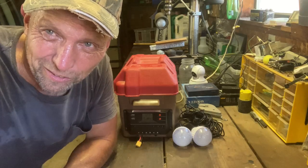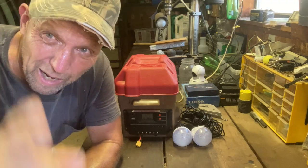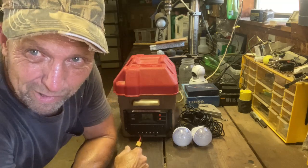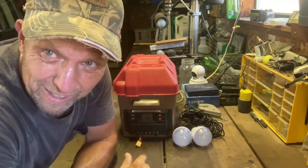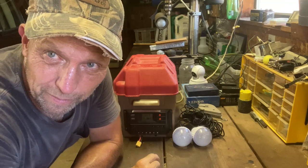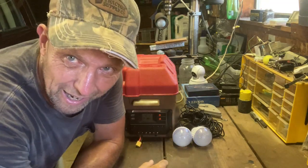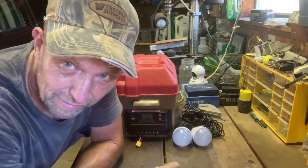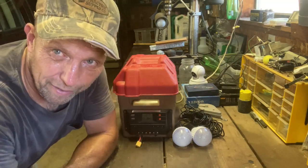Boys and girls, I'm sweating like crazy. One thing I didn't think about when starting a solar channel is that I'm going to be in the blazing Oklahoma sun all the time making these videos. The battery has topped off — it's sitting at 12.7 volts now after starting to float at 13.6, where it was only pulling one or two amps. It did go to float mode. My phone battery died out there — it's only been a couple of minutes of shooting this video and it died in that heat.